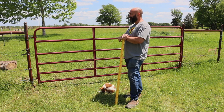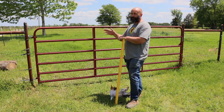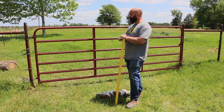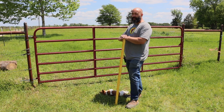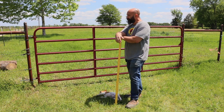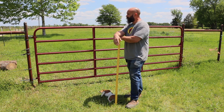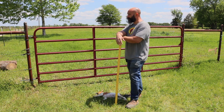Top tips would be, make sure that you know which way it's going to swing. If you have an option, go for the stronger bracing in the corner of the fence. Make sure it's parallel as much as possible. Second pair of hands, probably. Try to be straight on the bolts going through, but don't worry too much if it, like ours, turned out a little bit of an angle. Either way, horizontal or vertical angle, it'll be okay. Tighten those bolts, use a pipe wrench to tighten those.